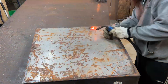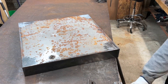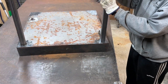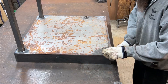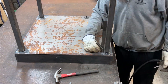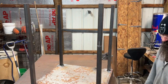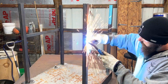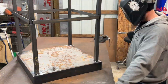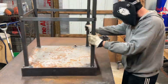With that all welded on, I moved on to cleaning off and laying out where I'm going to set my legs. Unfortunately, because there is a bit of warp to the plate now, I'm trying to keep them straight but it won't be perfect — and it'll be on wheels so it'll probably be fine. After I got the legs tacked on, I measured the center to center of each leg, grabbed some more flat stock, and tacked it on. When I tacked on the second side I did pull the legs in so hopefully they'll be a little straighter.